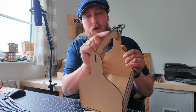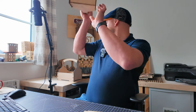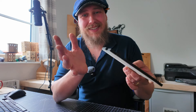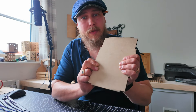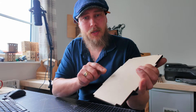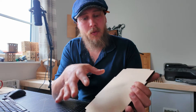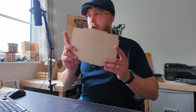It is a little bit flimsy when it comes to the handle, but you can get around this by doubling up the thickness and making that slot a little bit wider. Whenever I mention the measurement 6mm in regards to thickness, if you're going to be using a different thickness material just replace that 6mm measurement with the thickness of your own material. So first of all we're going to be tackling the base — the thing we need to bear in mind is we need to take off the thickness of our material from each side.